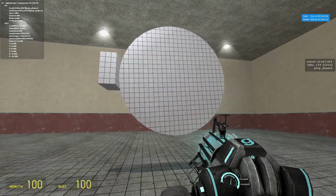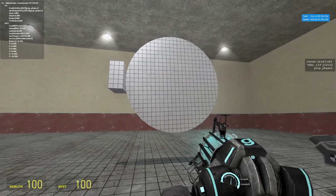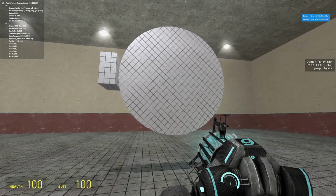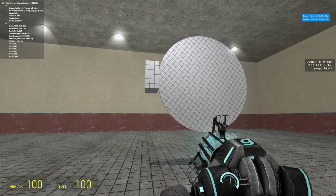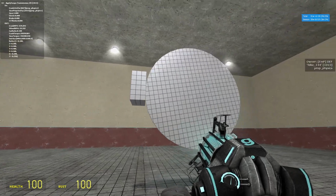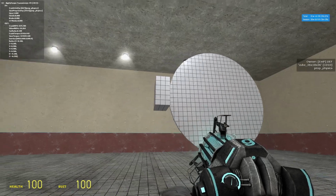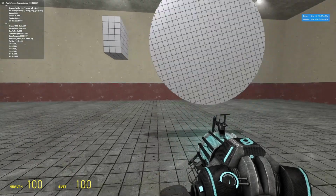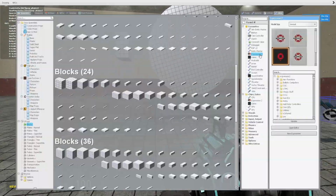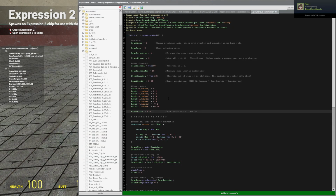you can see if you look at the crank RPM in the top and the wheel RPM at the bottom there, it's still running at 10:1. And there's a little bit of slip, but there's a lot of friction between this block and this wheel. And it's, for the most part, handling it pretty well. Now you can actually basically tune the gearbox a little bit.